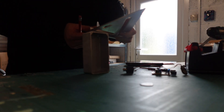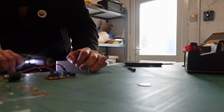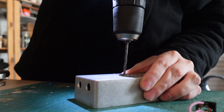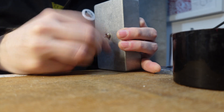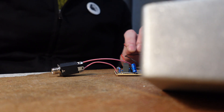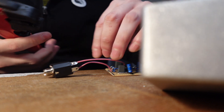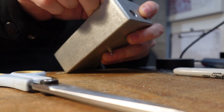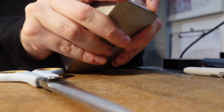So now I know that that works, it's time to drill the enclosure. As seems to be the theme for this project, I'm literally just making this up as I go along. I know I want two holes for the inductors, a hole for the output jack, and a space for the on-off switch, so I'm just going to pop that right in the middle. I also realized I need to snip the power connector so I can add it onto the switch, so it's not just constantly on draining the battery. I rarely use 9V batteries these days, so I grabbed some electrical tape to make a little bed for the Vero board to sit on so it wouldn't short against the case.